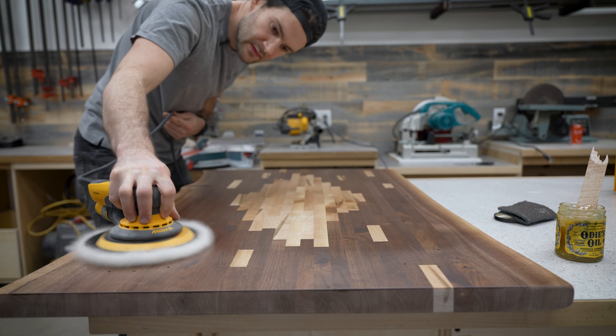After the buffing I gave the finish another 40 minutes to dry and then started reattaching the table legs, so that when I flipped the table over to do the top the still-wet bottom wouldn't be in contact with my workbench. Putting the legs back on was painless since I had already drilled all the mounting holes — I just fired in some three-quarter inch stainless steel screws and I was good to go. I actually saved the applicator for future jobs by putting it in a sealed ziplock bag so it wouldn't dry out.